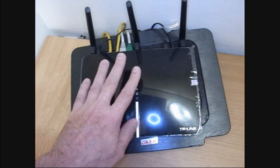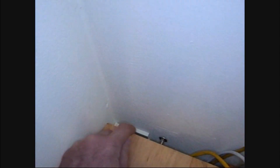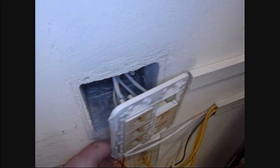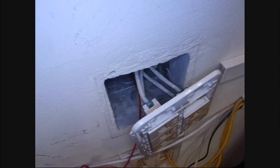Here's where I am. I'm going to replace the router with the optical router — really there's not much difference other than there's an optical plug underneath. The wire will go back here through this wire channel stuck on the wall. I've cut it so that it goes around in a nice arc so that the fiber cable is not pinched. It goes underneath here, along the top channel, comes along here, and will come out here and go through that hole. You can see the red string — you're going to see a lot of red strings. This is to allow us to pull the fiber through the wall easily.